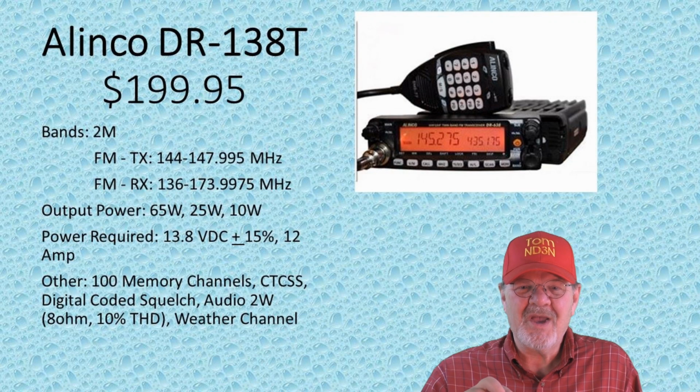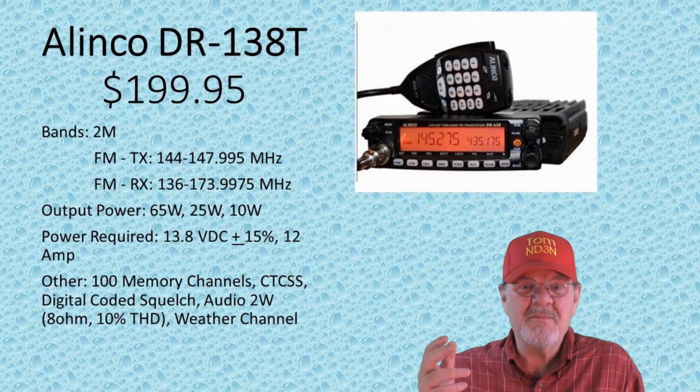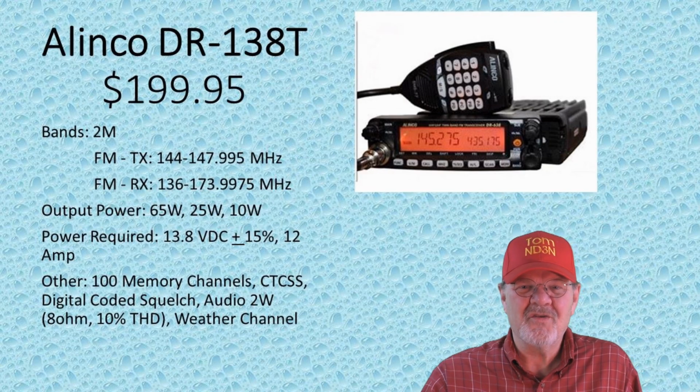And here's another Alinco. The DR-138T comes in at $199.95. It is a 2-meter FM rig transmitting between 144 and 148, and it receives between 136 and 174. It has 3 selectable powers at 65, 25, and 10 watts. It draws 12 amps at full power. It has 100 memory channels and an audio output of 2 watts into 8 ohms. It will also receive and monitor the NOAA weather channel.